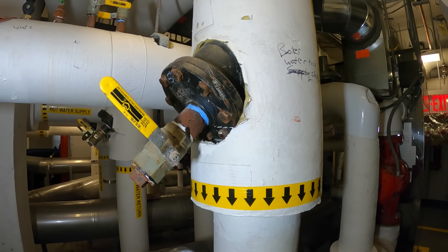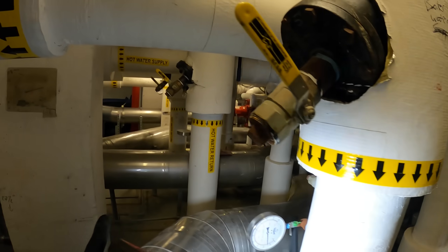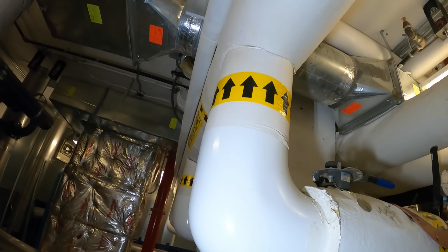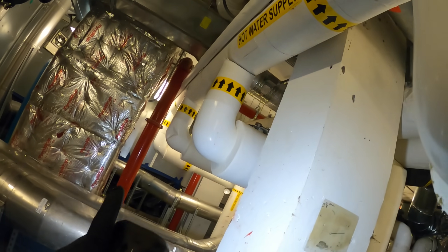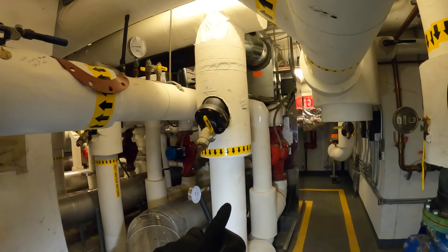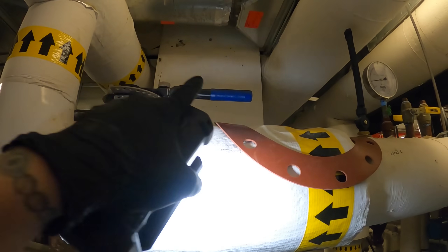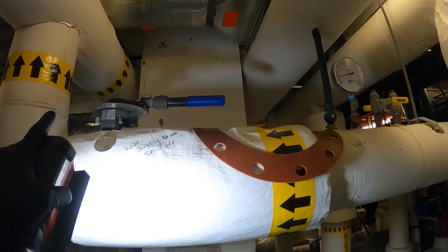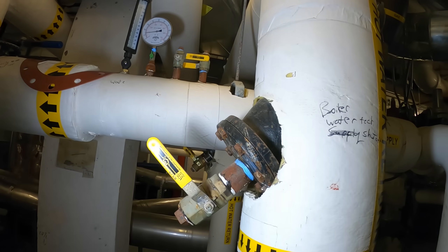What we're going to want to do, after we cut the power off safely for the machine, is isolate this unit from the others. As you can see, that's the supply — it's one boiler, two boiler, three boiler, and then four in the back. You want to isolate this boiler itself. Here's one valve — we're going to close this. As you can see, it's parallel with the pipe. We want it to cross at a 90-degree angle so we know that's off. We've cut off the supply.